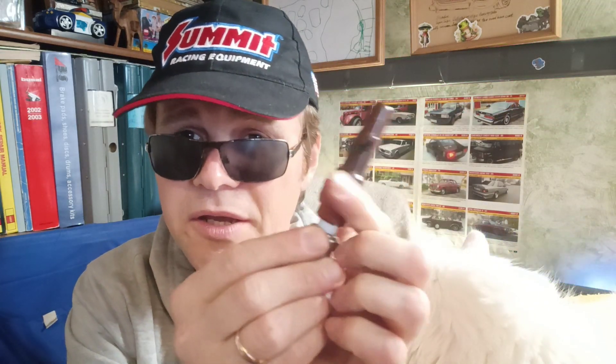What I want to find - here it is. You'll never find them. Probably a different color. Here - was burned inside. Yeah. You want to check this cap, spark plug cap, also with resistance, with a multimeter. You want to check this spark plug cap.